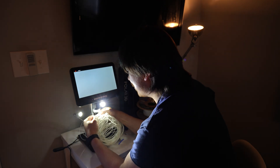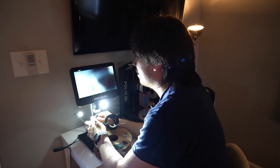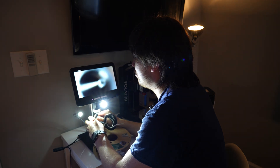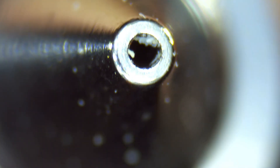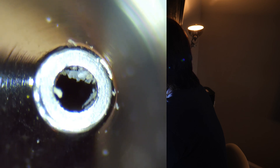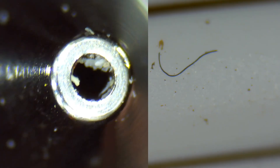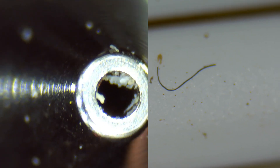Let's look at some random spots on this filament and see what we can see. Even though this looks clean to the naked eye, you can see there's all sorts of little pieces of debris — looks like there's sawdust, probably a bunch of pieces of human skin. Now let's take a look at an actual 3D printer nozzle and see what the size comparison is. The magnification is identical, and here you can see this is the diameter of the nozzle. You can easily see how something in the order of magnitude of those dust particles we were seeing on the filament could clog this nozzle tip — at the same magnification, those fibers can bridge the entire width of the nozzle.